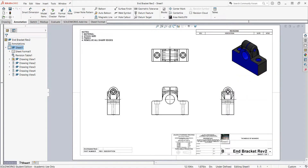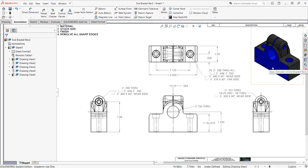I have not filled out the part properties yet, so none of my title block is populated or my notes, but I'll go back and do that later. So now I want to discuss how to dimension this cast part for machining. Recall that all these surfaces shown in black or dark gray are left as cast. After placing my views I've gone ahead and added dimensions. I'm dimensioning the cast part for machining, and all of the dimensions represent features which must be machined.